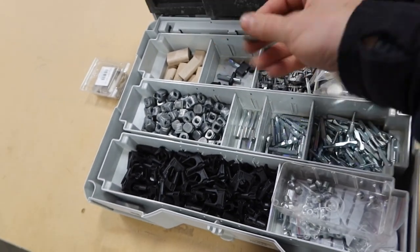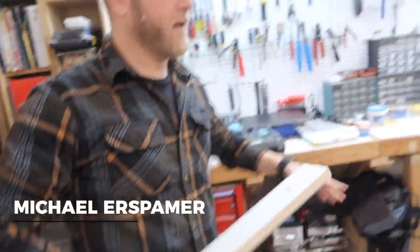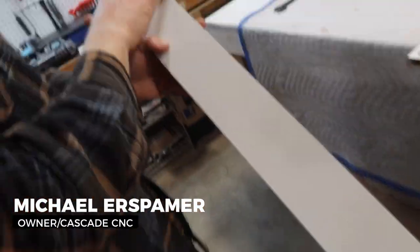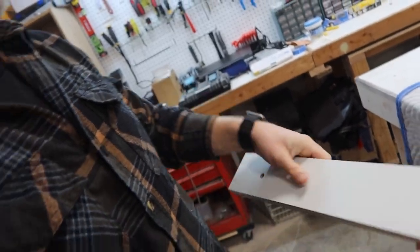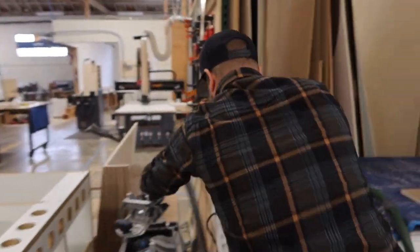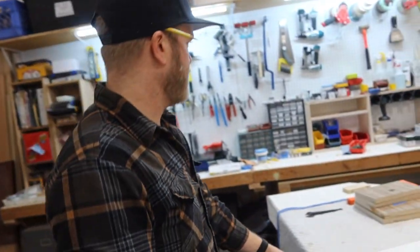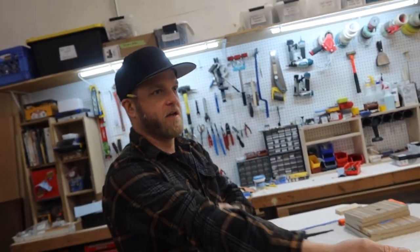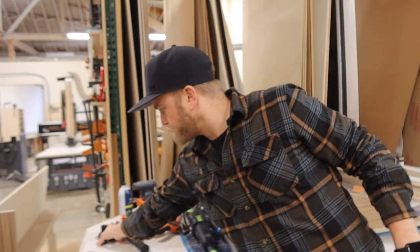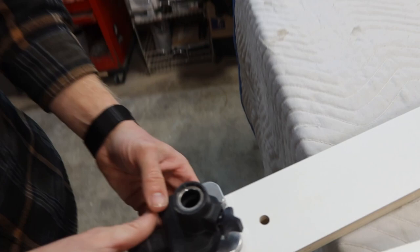These Festool kits have, what are these, like anchors, basically. So, for instance, okay, this comes off the machine. It's got these little engraving lines here. So you would use this tool, the Domino. Like a biscuit cutter. Yep. You line up that line with those engraving lines. That makes your cut there. Then from there, you would use this jig here. That fits inside of the hole, like that. You drill that. Yep. And it turns into that.